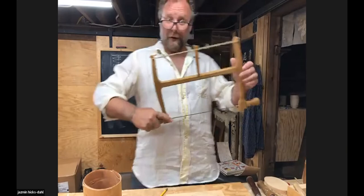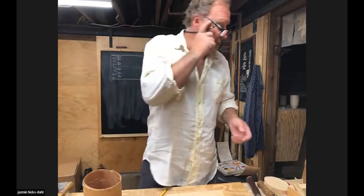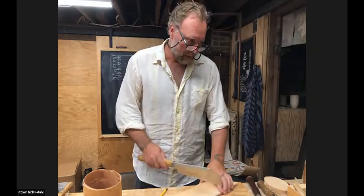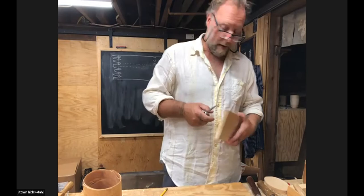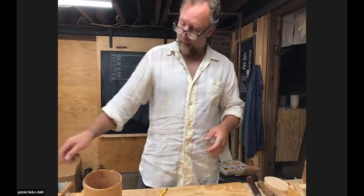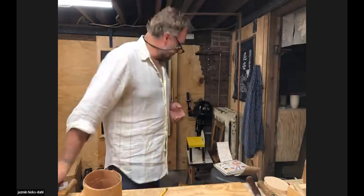And these are a turning saw, so you need to clamp this down, and you could cut all the way around. Or if you have a bandsaw, use a bandsaw. Or if not, you could use a straight saw and just cut as close to the shape as you can, and just carve it. So I'm producing these in mass, so I use a bandsaw. Or before, when I had taken some time off from electrical tools, I bought this and I just used this. This works great. So you rough cut it out, and then you trim it to fit.